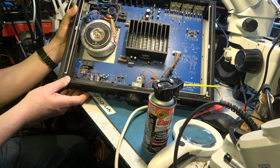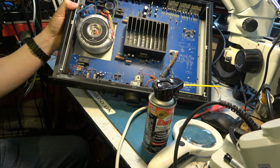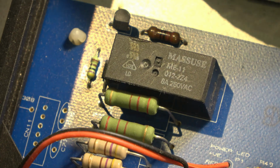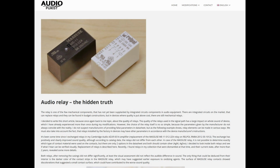So ideally I want to obtain a replacement relay of that type. I think that is our problem component right there. There's an interesting article about problems with the relay in these Cambridge audio amplifiers, link in the description below. So that suggests a better quality relay that I should obtain for this amplifier.